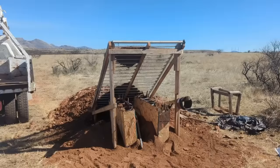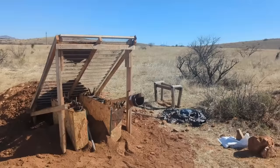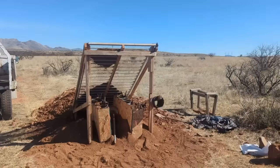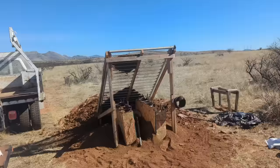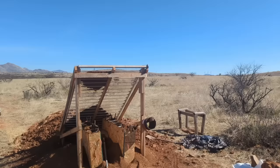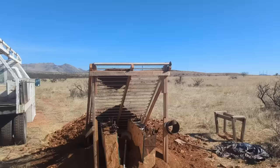That frees me up to say I don't necessarily need to add concrete to my dirt. One thing I don't quite understand about the Hyper Adobe method is when people add concrete to it. I understand why it's done, but it makes me question: what's the point? At that point you could just build your walls out of concrete. Yeah, you're using less concrete, but the amount of time you're putting into mixing it and putting the walls up — why not just use bricks? The thermal mass is going to be the same with solid concrete, or actually more. To me, it seems like a lot of extra work for the ideology of building with dirt, when you're doing all these extra things to prep it.